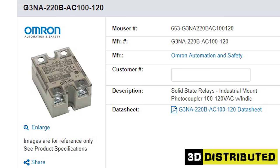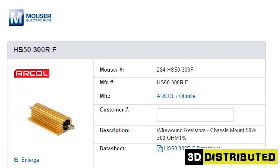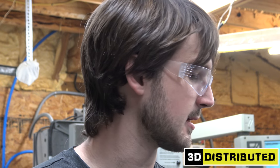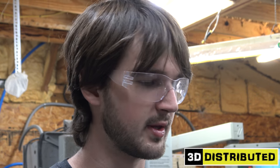That will give us 1.5 kilowatts of power. For the actual heating elements, we're going to use 30 fifty-watt resistors screwed onto the bottom side of the aluminum block. Ordinarily this would be a problem with localized heating, but with a one-centimeter-thick aluminum heat bed, the heat will be distributed rapidly, unlike with a glass bed.